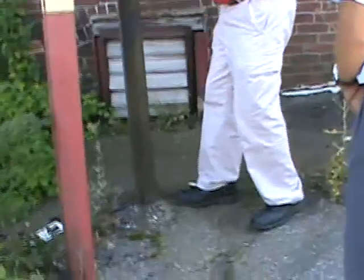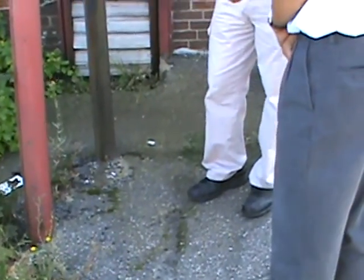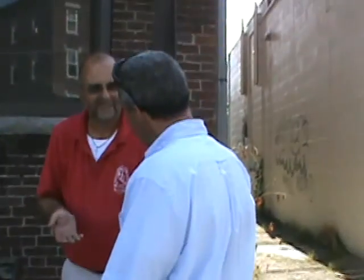Now I'm going to give you an answer right here. What we tell the clients to do, because snow will accumulate here: you clean this up, you're going to find a foundation of some kind. We get a Sonotube, about 12 inches. Piece of Sonotube, rip it in half, do this, sit it on top of the old one. You bring it up 6 to 12 inches above grade.